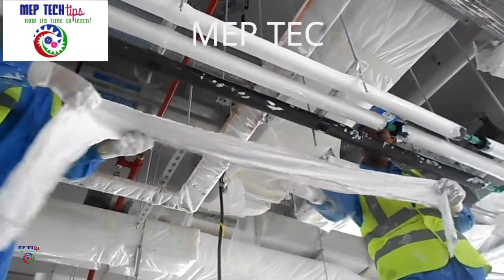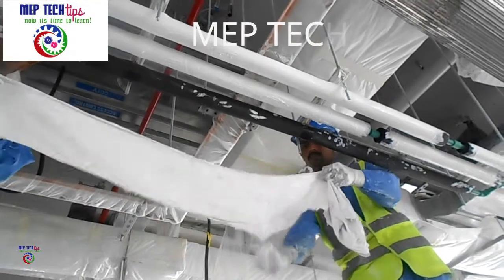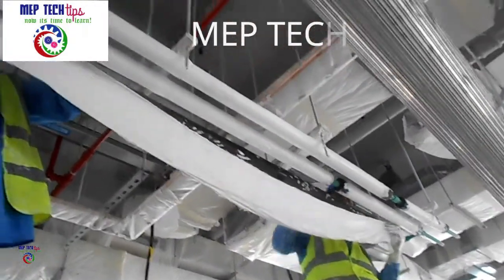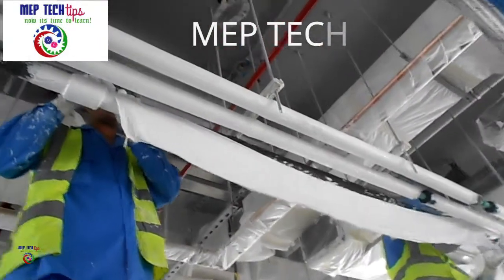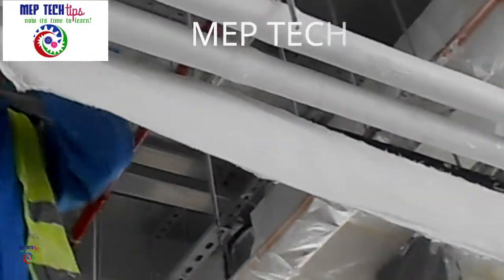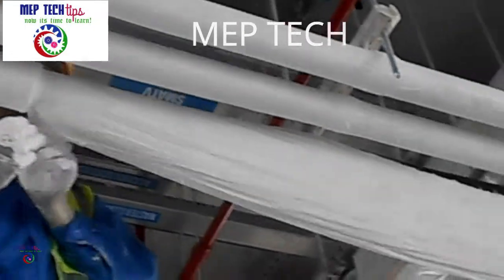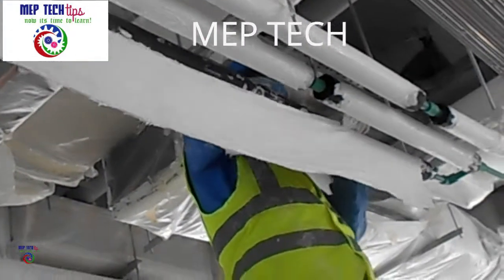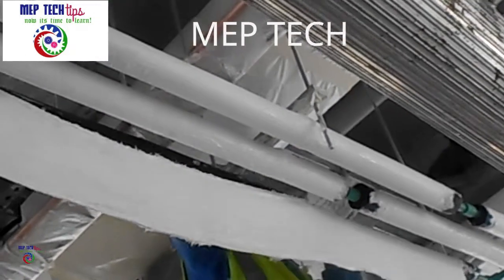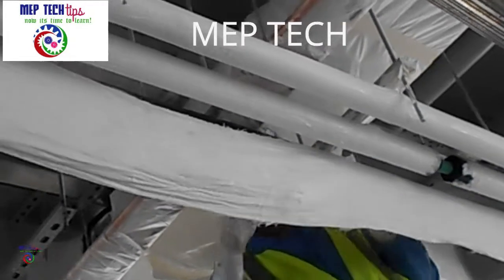First, the cloth you need to cut as per your insulation length — the outside should be a little bit less, not more. If you see the joints wherever we left them, that will be insulated later because it is left due to the pressure test not yet being done. The canvas cloth comes in long longitudinal lengths so you can cut whatever length you need. Proper dipping is very important for the canvas cloth.